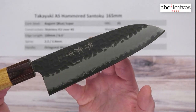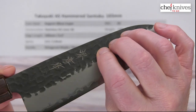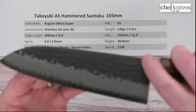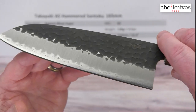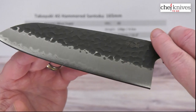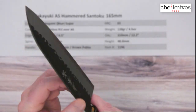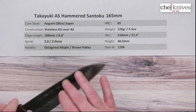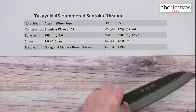There's a lot going on here. We've got the hammering, screened-in kanji on the right side of the blade, your core steel, and your cladding with a nice cool wavy line. On the left side of the blade they've got again some screened-in kanji, the hammering, the grind, and the cladding giving way to the core steel. They've done a little bit of relief on the corners of the spine and a little bit on the choil. It's a fairly stiff blade — the grinds are clean and the blade is nice and straight.